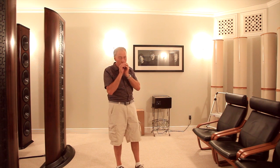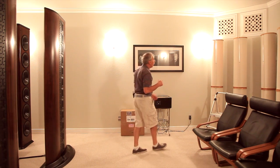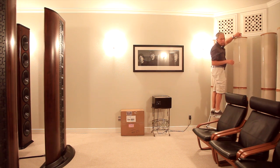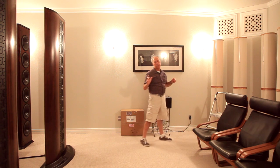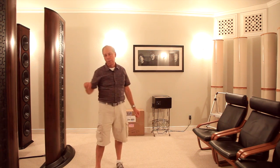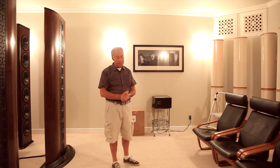So the resonant sound is coming into the chamber and being dissipated. Here's what we're going to do. My first step is to get up here and cover every one of the resonators with cardboard. The cardboard is going to stop the resonators from doing anything — just block them. We'll make a room measurement, and basically we're just going to sweep a single tone through the room, measure that tone, find where the bump is. Let's get started.